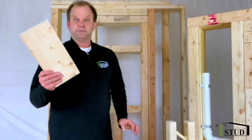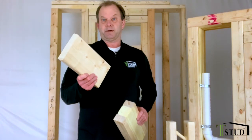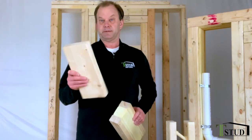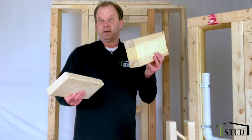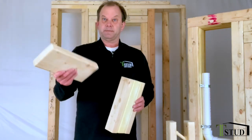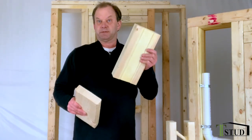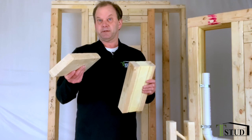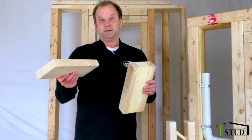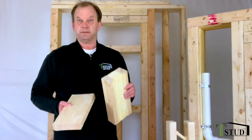Simply, two by six, two by four — take those, throw them to the side, put your T-Stud in. These are certified to hold roughly 2,200 pounds if it's a number two — not a stud grade. A two by four number two is certified to hold about 900 pounds. We're certified to hold 8,600. So when you're out there framing and calculating loads coming all the way down, just remember that if you're going to use as much of this design value, you have to make sure that we don't crush the plate. A number two plate, SPF, will crush at 3,600 pounds. So you can get by with a whole lot fewer studs in your house or building structure if you use the T-Stud.